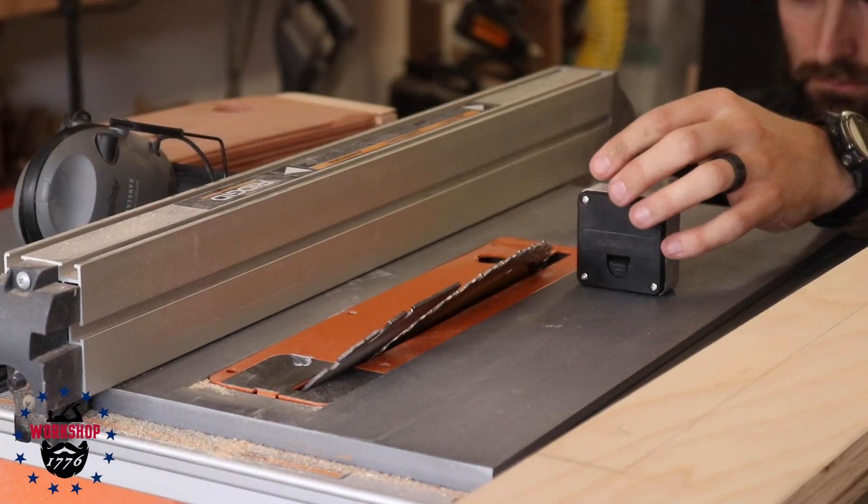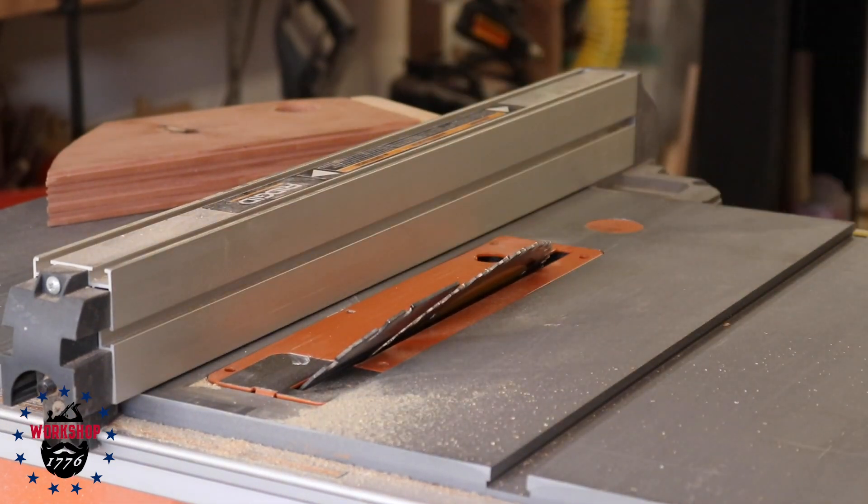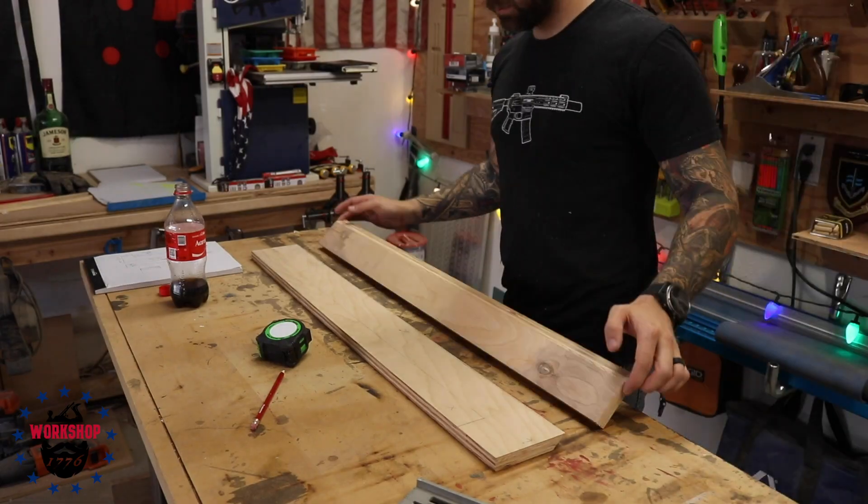What I ended up doing was ripping all of the pieces to the right widths and then canting my table saw blade to 45 degrees using the little Wixey digital blade angle finder — I don't know what it's called but the thing's awesome. It makes your life a lot easier, especially if you have a cheaper table saw like I do that isn't very accurate. The easiest way to make the bevels on the correct sides is to cut your pieces to width, lay them out how they're going to be assembled, and then mark on the correct side where you're going to put the bevels and which way they're going. It makes your life a lot easier when you pick up those pieces and move them to the table saw, knowing how to orient them and cut the correct angle so it all goes together as a box. Make sure your layout's good and mark it correctly — that will help you when making these cuts.